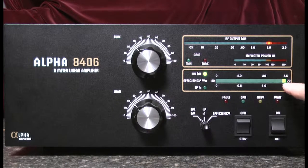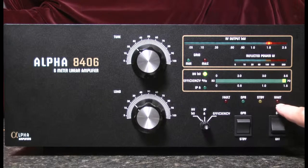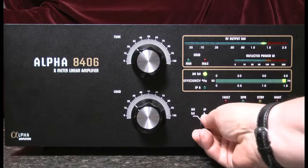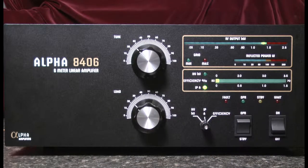We also note that the high voltage scale should be at the far right. Likewise, the standby and wait LEDs are flashing through the warmup period. Next we can rotate the multimeter selector to plate current, and note that the plate current should be at zero. We'll leave it in this position until the warmup period has ended.